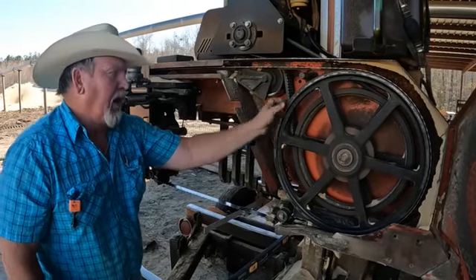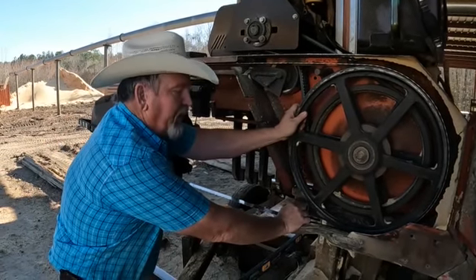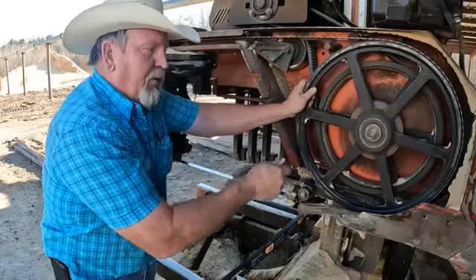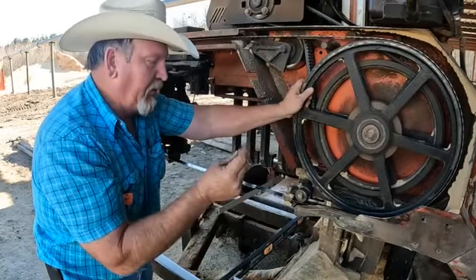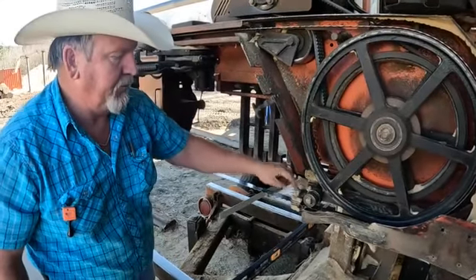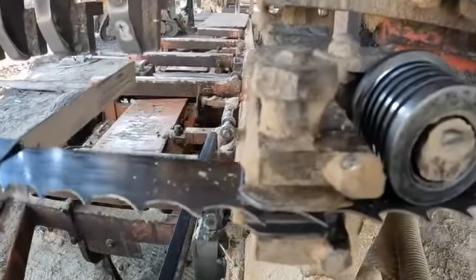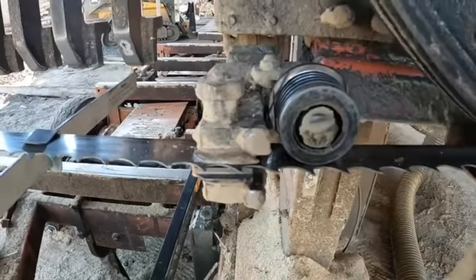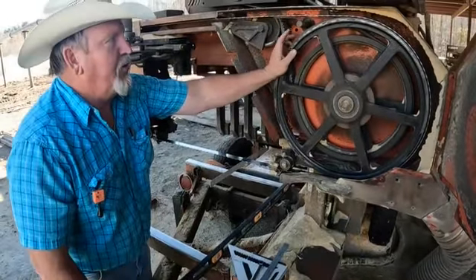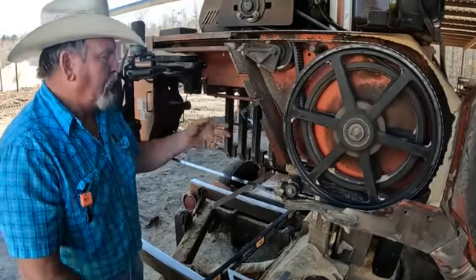All of these things are covered in your owner's manual — mine is sitting right next to my saw blades and I still use it religiously. Some of these things I don't check very often because unless a bolt gets loose, it's pretty rare that mine gets out of alignment — except for the tilt, up and down, as the blade guide roller wears. It's going to start shaping like a cone. Once I get a few thousandths of wear on it, I replace them. This is a consumable item — you can only adjust it out so much before you need to replace it.